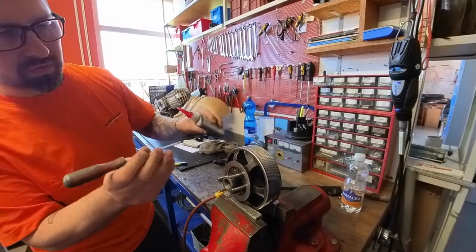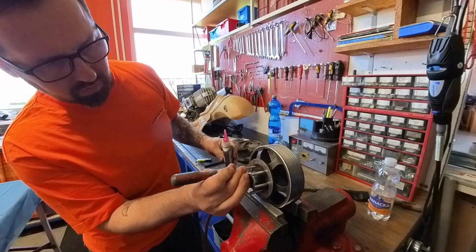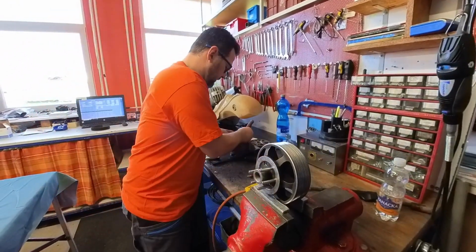It's mostly for me about balancing two issues against each other: using blue Loctite and having the possibility of the drag spike loosening up a bit, versus using red Loctite, where it won't come out but is much more difficult to loosen when applying heat and going through the whole process to remove a broken drag spike. To me, that balance sits on the side of blue Loctite, and therefore that would be my personal recommendation. We'll ask later about why it's red.